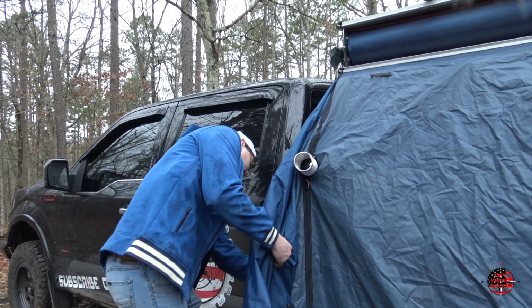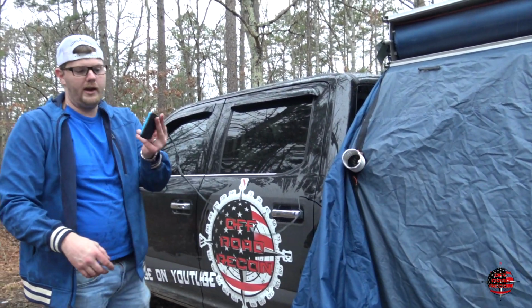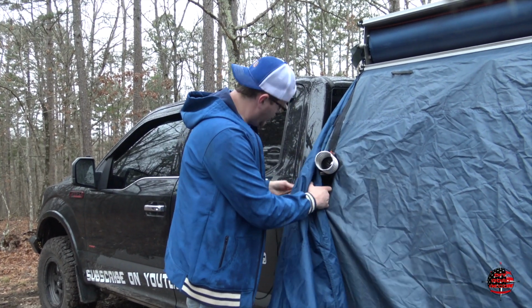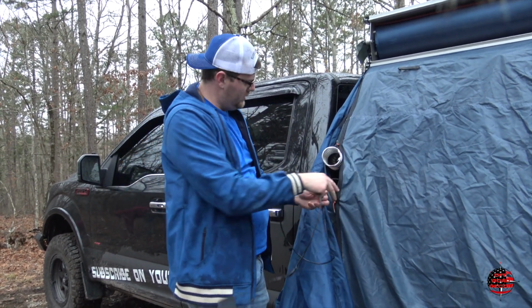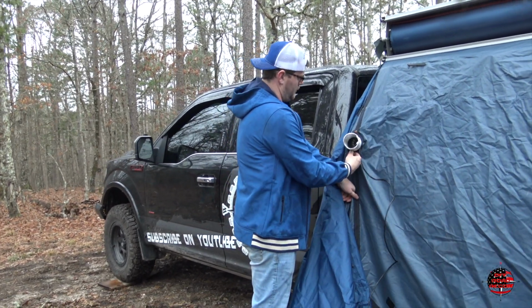Don't forget it. So it's behind me. This is also where we bring our HVAC controls through. And I always bring them through on the bottom just because there's more cable. Then also it's not sitting on your hot HVAC. And we take enough slack on this to get it up into the upstairs. And then zip it tight.